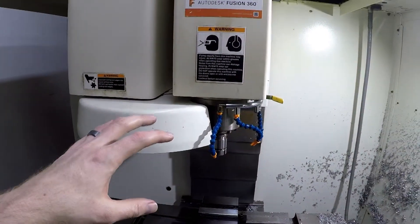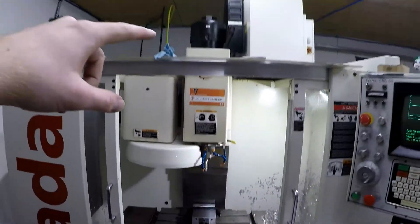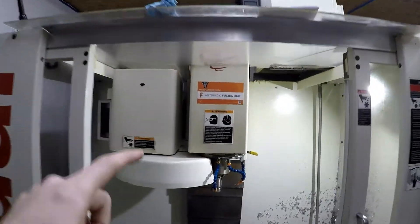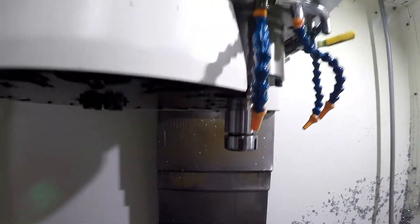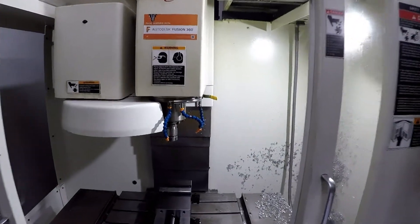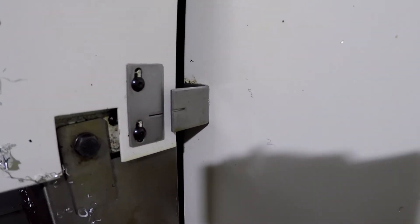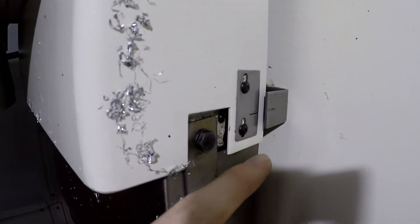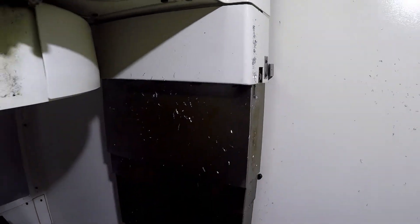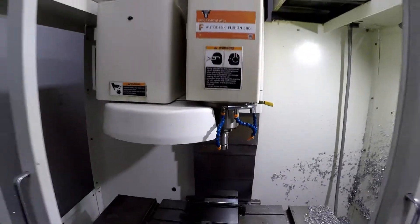All right guys, I'm back down at the machine. I haven't tied that up yet or put the cap back on and the screws, because I mainly want to try this now since it's all lined up. I want to try and do a tool change and see if it works. You can also see back here — I noticed the position is now south of that line over here, so once we get everything lined up I'm going to readjust this to line right back up to where the machine mark is for the cold start position.